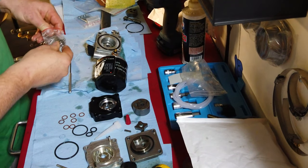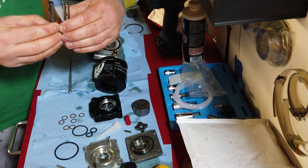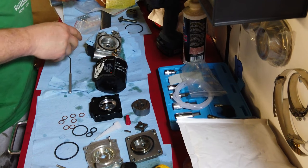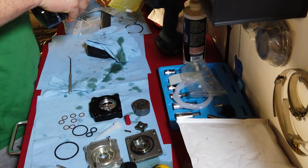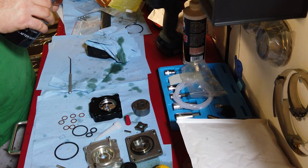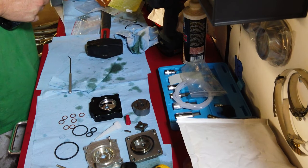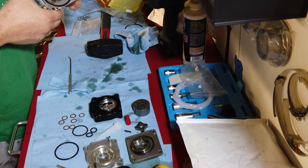Okay, here's the new shaft — it should just be a little bit taller. Yep, it is — just a taller version. Get a little oil on that, and then we'll push it back through there hopefully nice. Let me make sure I'm not forgetting anything — put the shaft in, put the pin in, put the rotor in. Yeah, that should be right. There it is, popped right in there. Let me just tap it back just a tiny bit.